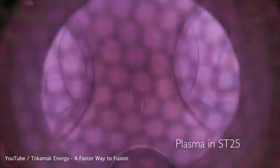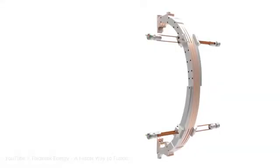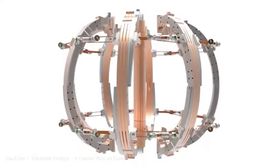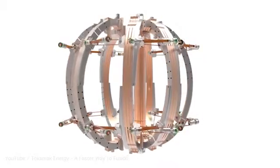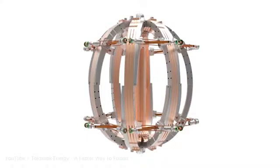They come together as follows. Inside the solenoid there are 24 wedges that fit together. These form part of the big toroidal field magnets that loop around the donut vessel. There are 8 sets of 3 limbs that are bolted together and electrically insulated that connect to the wedges in the center column and form the toroidal field coils. Grouping the limbs together makes it easier to access the plasma through the gaps. The orange pieces here are strengthening. The high magnetic fields and high currents can generate large forces on the machine.